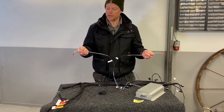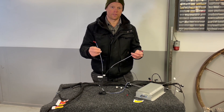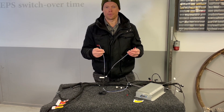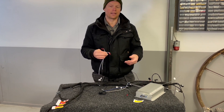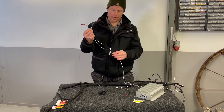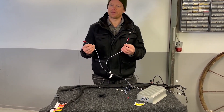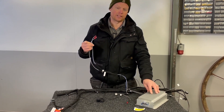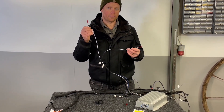As you can see I have two supplies here. One is the main supply and this will be connected to a transformer that will take power from the grid. If I have a power outage there will actually be one second of blackout, and the BMS will probably release the relays, leaving me without any backup or EPS power. So what I have done is soldered in a small diode here so I don't charge this backup battery. When the grid fails for one second, this backup battery will supply my BMS with backup power, and then when the grid is back I will directly take power from the main supply again.